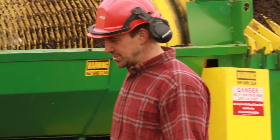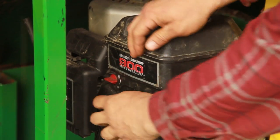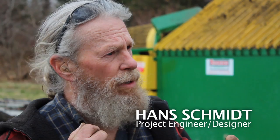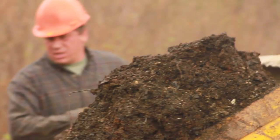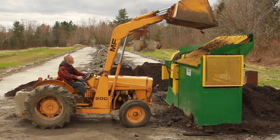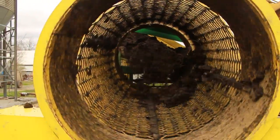It's a very small, 6 horsepower, 6 to 1 reduced Briggs & Stratton single cylinder engine. And it seems like it's not enough horsepower to do the job, but because it's mechanically driven — all mechanically connected instead of hydraulically — you can save a tremendous amount of energy in heat loss through hydraulics. So the end product is you have a very efficient machine with a very small engine.